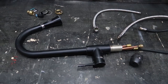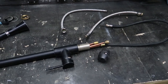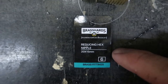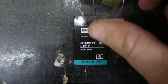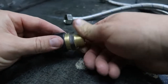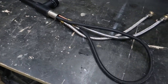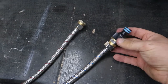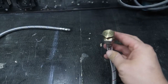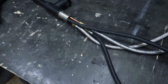Here's the mixer tap I've selected. Being that I'm only going to be plugging into the garden hose I'm not going to need hot and cold water. The piece we'll be using for the garden hose is this one here — this is a reducer, it's going from 20 mil down to 15. This end here goes to the tap and it's up to a 20 mil which fits the garden hose. The hot water connection is just capped with this brass fitting here, and this is the mixer which is also redundant.